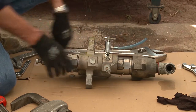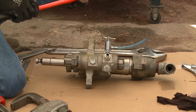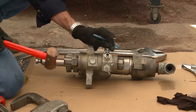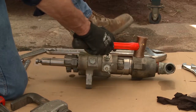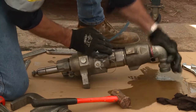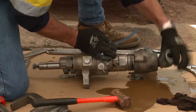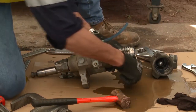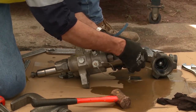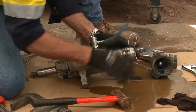On this knockdown section here, we grab a soft tool — brass — we can use a brass drift, or you can use the Stilsons to undo this. They've designed it so that you can undo it with a hammer. Remember: righty tighty, lefty loosey. So we undo this and that exposes the nylon sealing ring and the precious ring land that can be damaged quite easily.